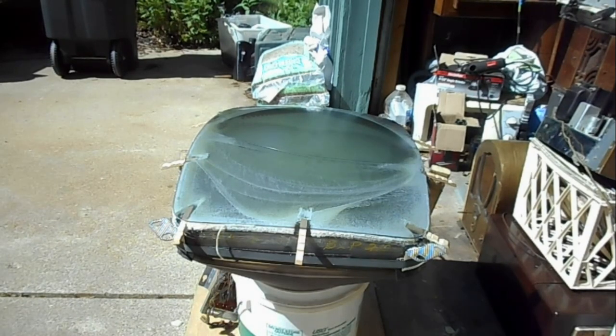It's really surprising that the Zenith guitar string method actually is working on an RCA tube. I've tried it on many, many RCA tubes, probably as many as 10, and nothing has ever responded favorably in an actual RCA-made tube. I've had one Philco-made CRT that had an RCA-looking cataract, but it was soft in the middle, unlike the RCA cataracts, which are usually uniformly fairly hard throughout.